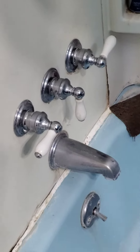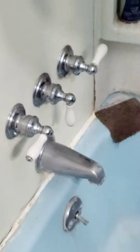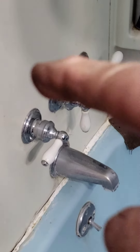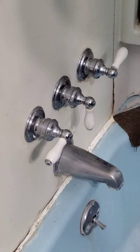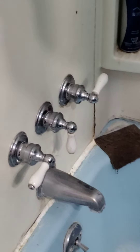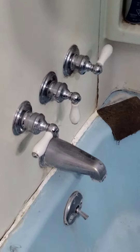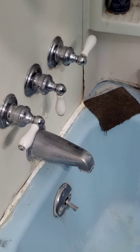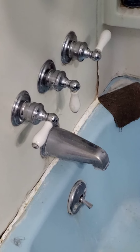The problem I had was I wanted both my shower heads to rotate up, so I had to reverse the far side. I couldn't find anything online to tell me how to do that. What I found was that the white cap on the front — just take it off, which does not come off easily, reverse it, and put it back on in the opposite position it was in, and you will have a reversed valve.